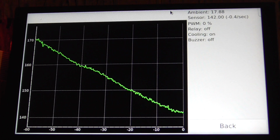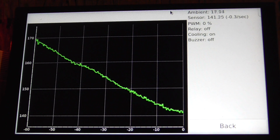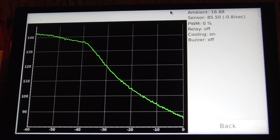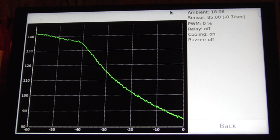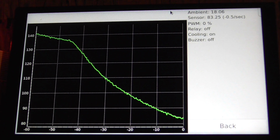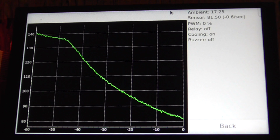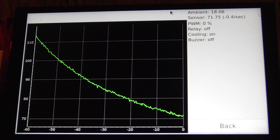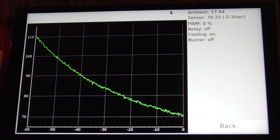Let me put that other big piece of aluminium on. This is why they use conveyor belts, isn't it? Because you want the board to be physically moving out of the hot place. You can't leave it sitting in the hot place. So that's 50 degrees per minute, but we still need to go fast, 4 times that fast almost.